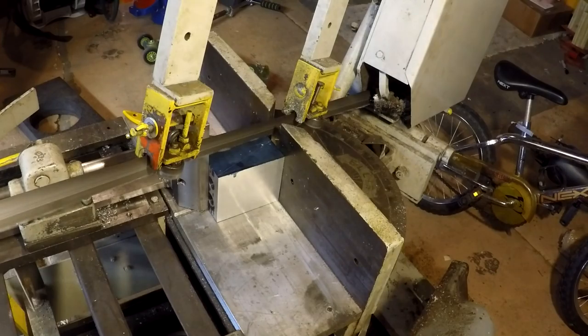All right, we're getting ready to make a cut, and you're probably thinking to yourself, well, how are you going to make that 18 degree cut or 60 or whatever cut on your bandsaw with some funky setup? Wrong. I have an Ellis bandsaw. It miters. If you look way back there in the back, you'll see that there's a big miter gauge. I rolled it over to 18 degrees, lined it up by eye, basically, because that's good enough.